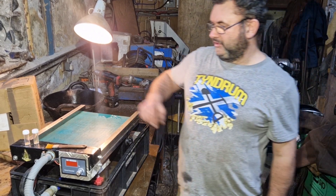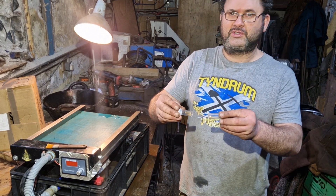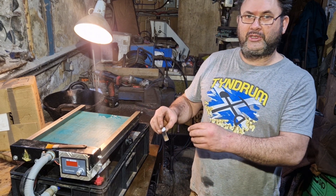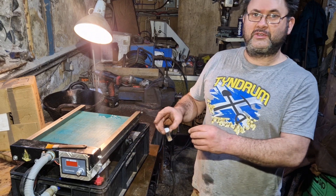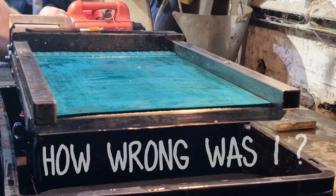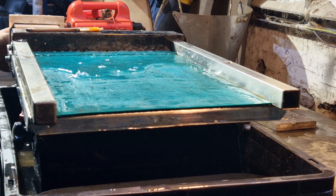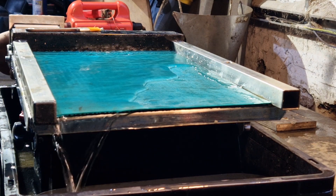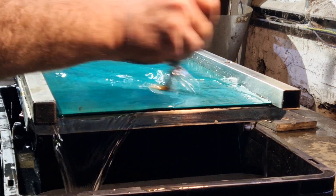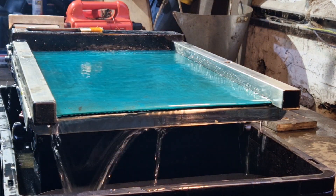Today all I'm going to do is — we've got minute bits of black sand in the gold — put all the gold on the table and see if we can wash the micro black sands out of it. We've got the table level and flat. We're going to put the water on at a very low speed. Never pour your gold on the table and then start the water — it will just wash off the end. So we're going to start it up at slow speed, then add the gold, then raise the bed until the micro black sand starts separating.